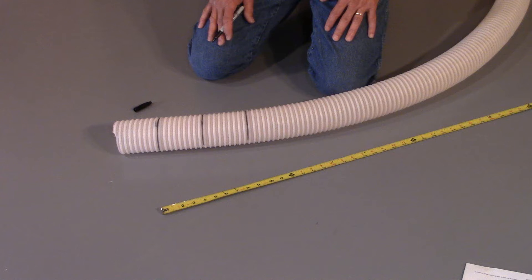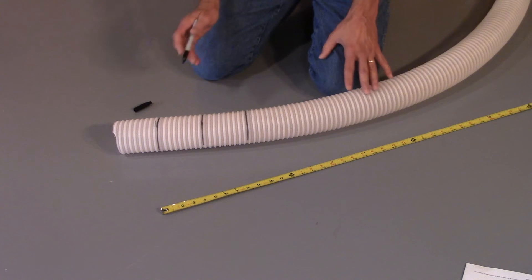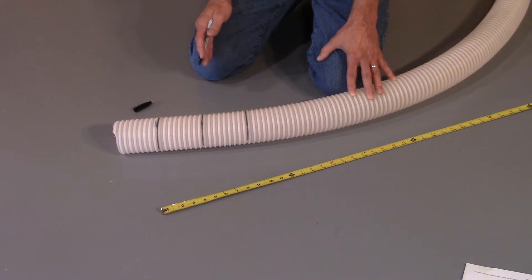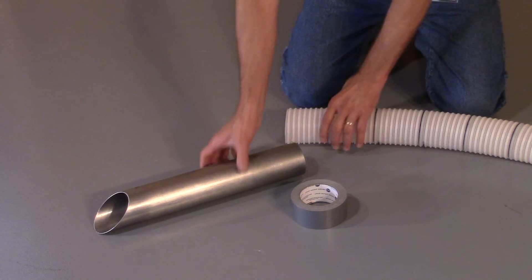We're doing the four-inch marks, which is about every nine ribs on this hose, for the length of hose that will be inserted into the cavity — usually about 25 feet. The good news is that you only need to do this one time.